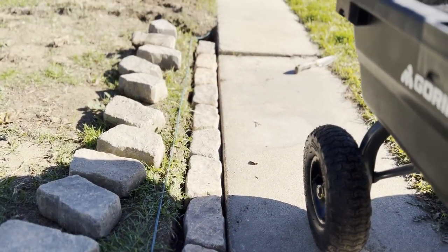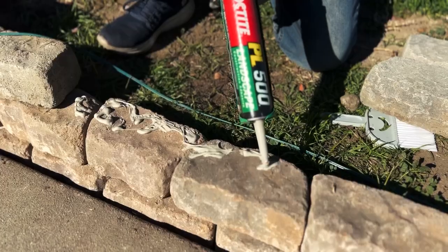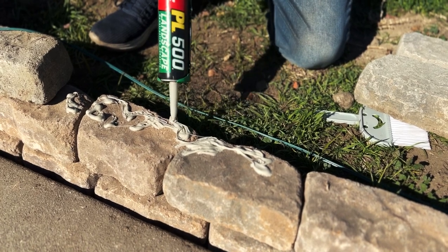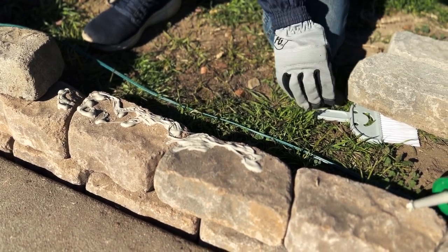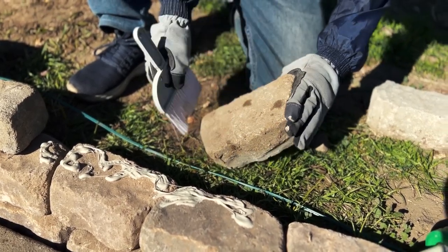This beginning row I made almost level to the ground so that soil isn't popping up, and the wall will be completely level, but the sidewalk does slope slightly inward and down because of time and for water drainage.